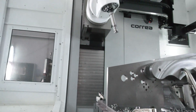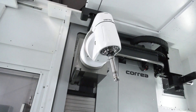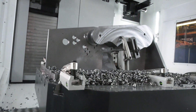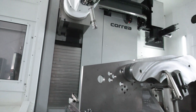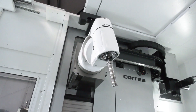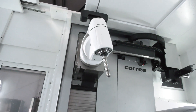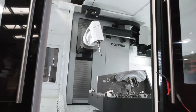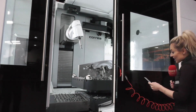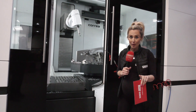There are two indexing axes on the UAD head and one continuous axis, which is that rotating square pallet table. Now let's talk about that head — the ISO 50 Big Plus. It has 364 million positions, and the machine has 33 kilowatts at 900 newton meters of torque continuously. That is a lot of power.